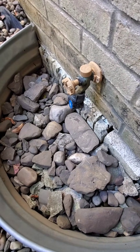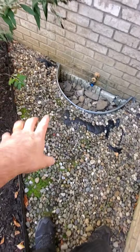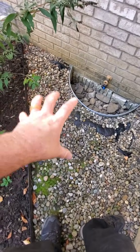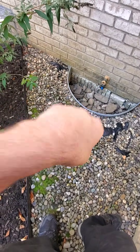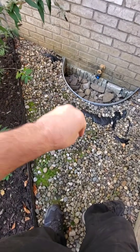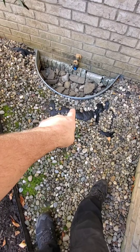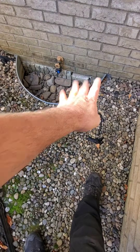To make matters worse, you couldn't pick a worse spot for a hose bib. And they put that beloved drain rock right here. Why don't I love this? Because water trickles through rock, promoting water to go down into the ground. Think of it like a leach field for a septic system — when water goes into the ground, it spreads out and goes right underneath that window well toward the foundation.